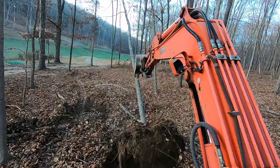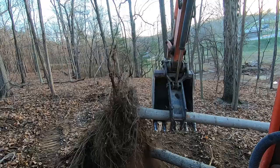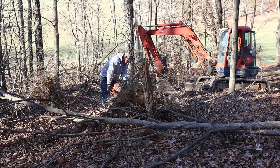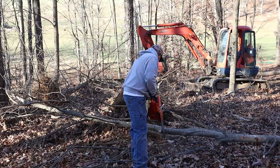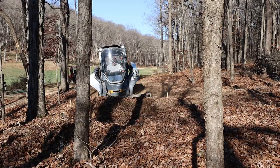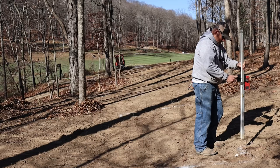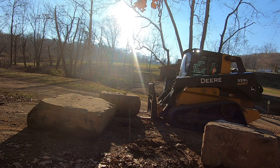A few of the keynotes you'll need to know: we will be extending this tee box back into the woods approximately 60 yards, so as you can see we will need to remove quite a bit of trees. We will be using synthetic tee box turf — the lack of sunlight in the shoot we are creating will not allow us to maintain a decent natural grass launch zone. The natural grade up here drops from side to side over 22 inches, so we'll need to install a retaining wall on the lower side.